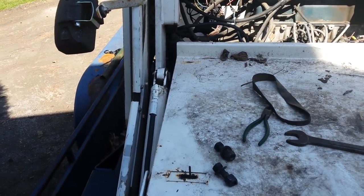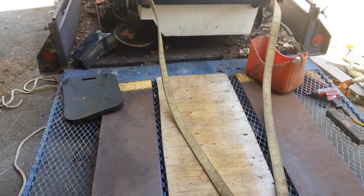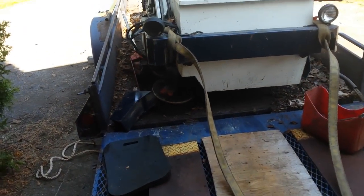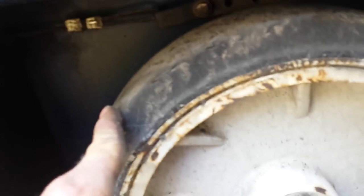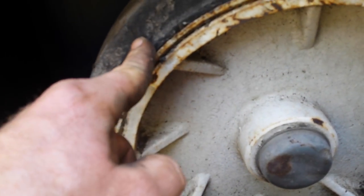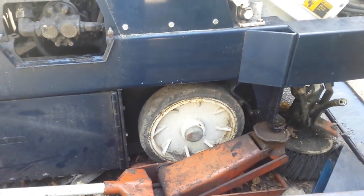This thing is really tiny — fits right in our trailer — but it's hard to load and very heavy because it doesn't have pneumatic tires. I had to mount steel plates on the trailer ramp, and this is the only trailer we can put it in. If I were shopping for another one, I'd be looking for one with pneumatic tires, because as they wear you just change them. I priced out these wheels — you buy just the rubber with the steel, cut right through to pop the old one off, then put the new one in an oven or out in the heat with dry ice on the hub and they just drop together. But they want like $500 for two wheels, so I said no.